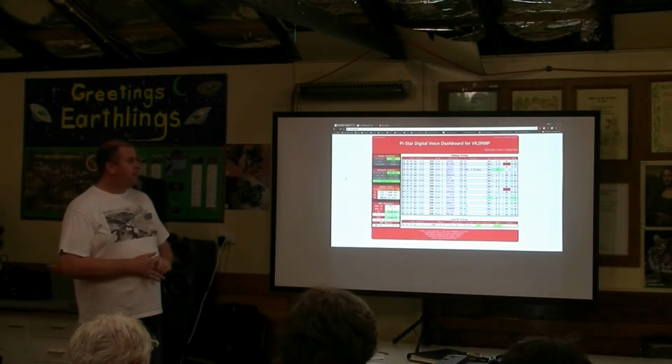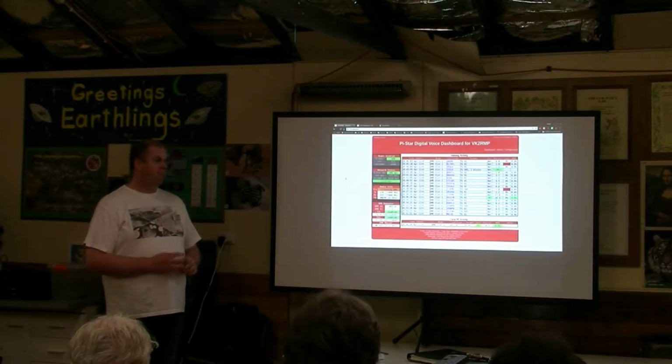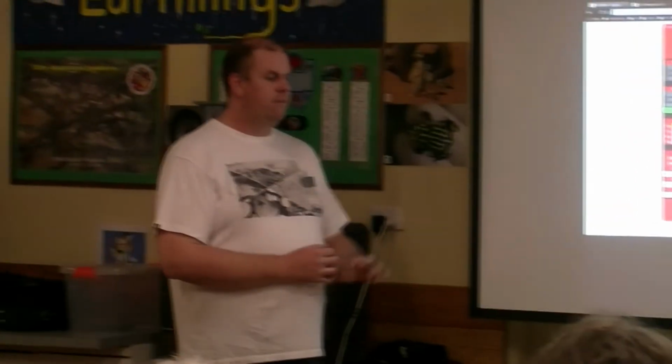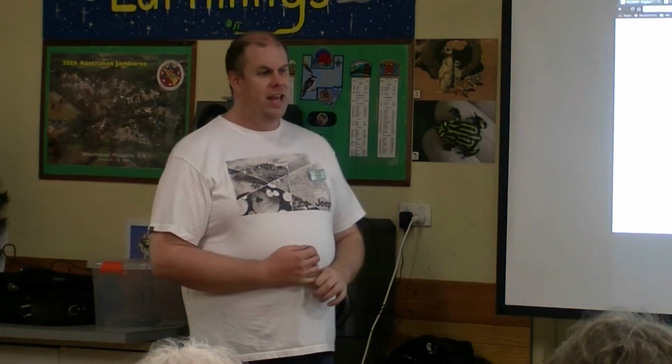Now, the DMR repeaters, especially the Brandmeister repeaters, do support location services. So it's supposed to be able to bridge from the repeater to APRS. I've only had my HD1 radio for a few weeks, so I haven't actually managed to get that up and running. I do want to have that running before it goes in, because I want to actually use that one myself. If you're using the MARC network, they do ask that you turn off location services, so do not broadcast your position.